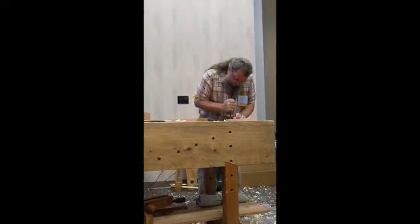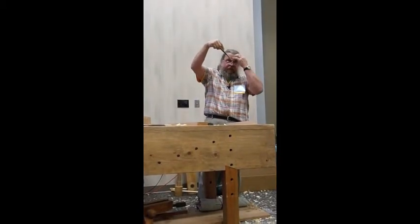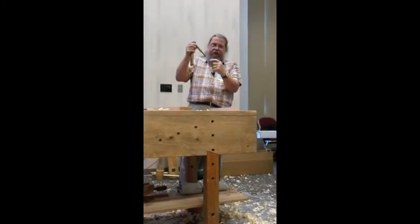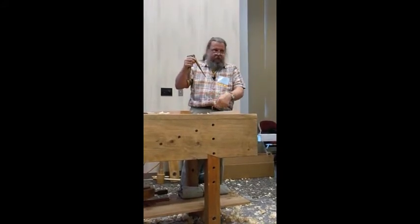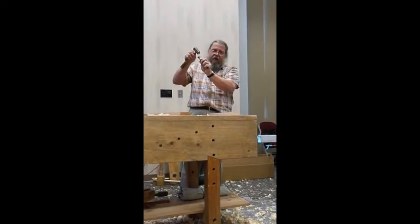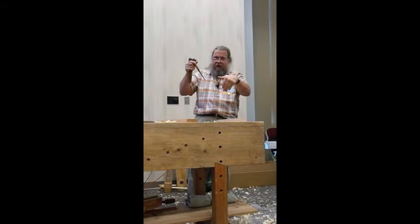So if I'm having a problem with tear outs, then I'll compare with the vertical side and use this bevel as a plumb line. Because what happens when I hit it with the chisel, I've got force going down, but I've got pressure against this, against the end grain. A lot of wood pulls out and you get a big hole in the middle of the grain pulling out. If you're going down this way, there's shear and it just pulls out. If you're hitting this way, you won't pull that out because you're pressing against the surface with this edge and pushing against it as it's going down.